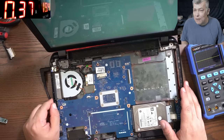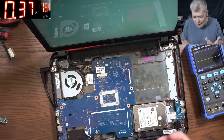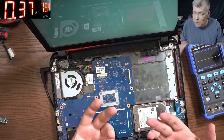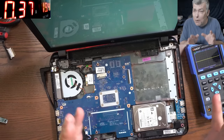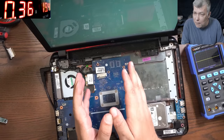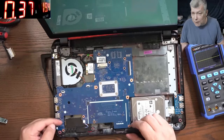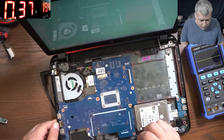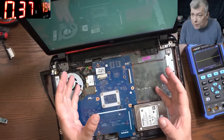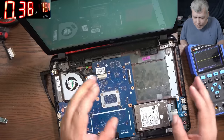But being sloppy, actually the way to go with this kind of fault, where you have no picture, the first thing you have to check is the data lines. You have backlight, okay, fine. You see actually it's loading Windows. You can see the hard drive activity here on the LED. Very simple to check with an oscilloscope. It takes a few seconds.